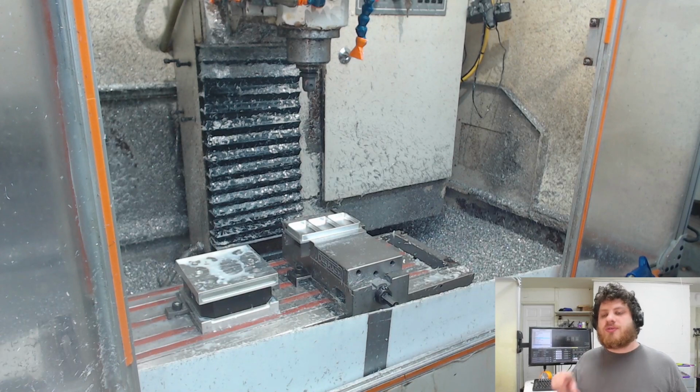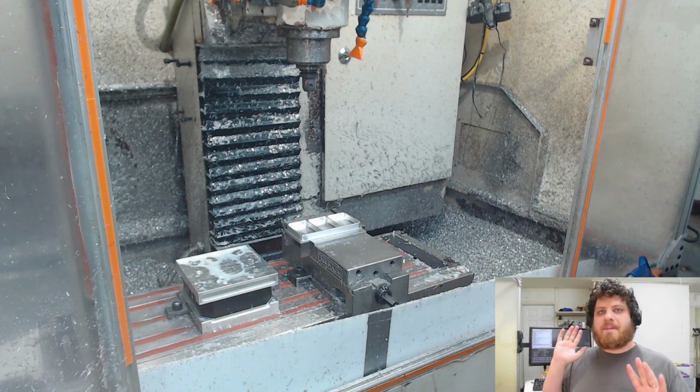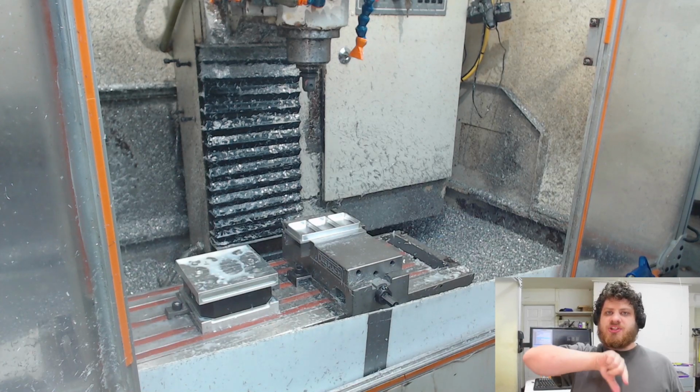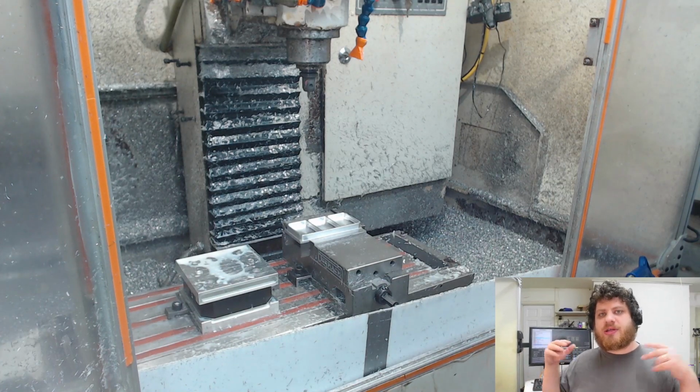Okay, that was close. It did get those corners, but due to some backlash, there's a slight little mismatch in the fillets. The way to fix that is make it do two finishing passes. Honestly, I thought it should have done that already. So I'm gonna go tweak the CAM and we can rerun that again.